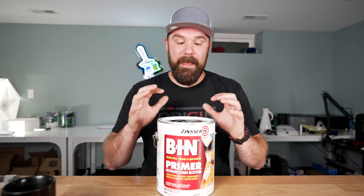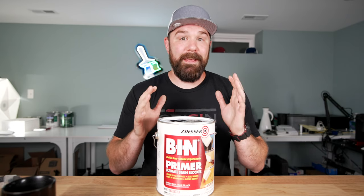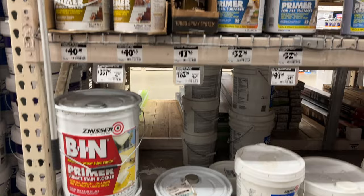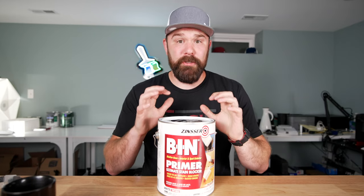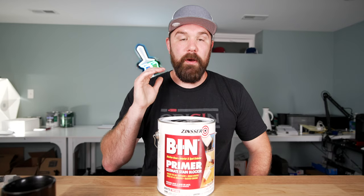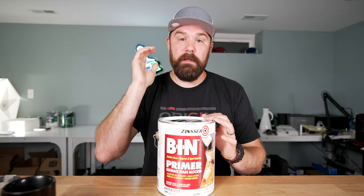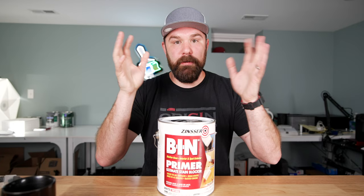You can go over almost anything, and I have yet to find a product that's more effective at doing what this can do. I've tried almost all of the primers, both oil-based and latex-based, from Sherwin-Williams, Benjamin Moore, Home Depot, the other Zinsser products like Coverstain, and nothing really beats this. If you know something, hit me up in the comments. Also, it dries super quick. A lot of the oil-based primers take a while to dry and flash off. As soon as it dries — which is like within 20 minutes — the odor dissipates really quickly, and it has an eggshell finish, so it dries really hard and really smooth. When you go over it with your top coats, you get a lot of good spread, whereas with flat primers it often looks splotchy on your first coat. This looks pretty even right off the jump on coat number one.